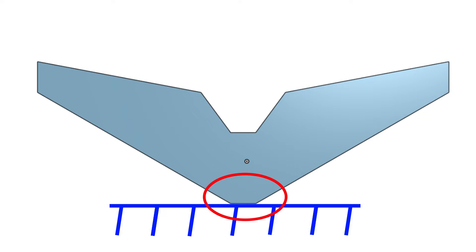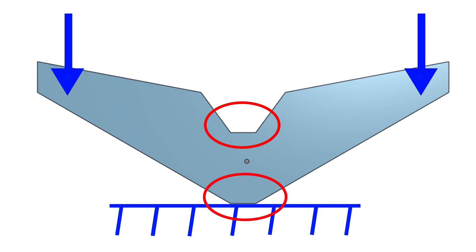The wing comes to a sudden stop and we're going to have a lot of stress right here at the front where we've made contact with the ground. However, the wingtips have not stopped. Out here on the wingtips we have a lot of objects with a lot of mass — our winglets, elevons, servos and linkages — and they really haven't stopped. The mass wants to continue towards the ground, creating a lot of stress right back at this section of the wingtip, and where we have these corners cut out for our motor and prop, we're going to concentrate a lot of that stress right in those corners, which is going to lead to a crack.